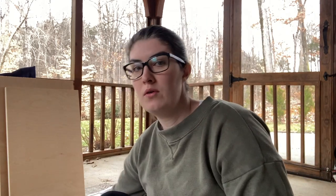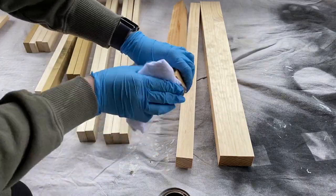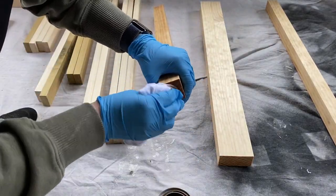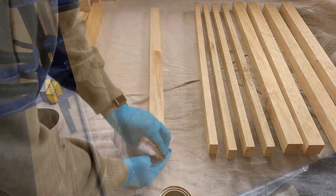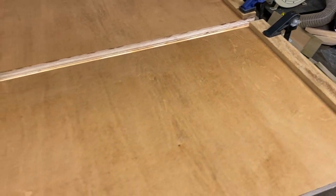I am back from the barn and I'm going to be using the Minwax Special Walnut stain color. I have a couple of boards that are very yellow in tone compared to others, so I'm going to have to layer on a kind of gray wash to help tone out that yellow and get a nice even color throughout. I did actually end up picking up different one-by-twos than the yellow ones, because after I was done staining I just did not like the difference in color. I tried doing a whitewash and it just wasn't coming out how I wanted, so I got some new boards and they matched much better. Right now we have these half-inch detail pieces that are glued to the plywood and we're just going to let them dry before assembling.